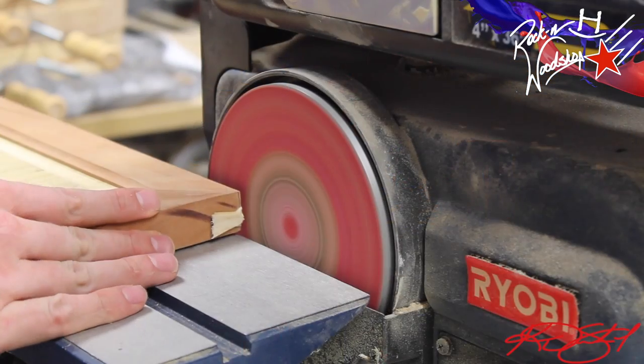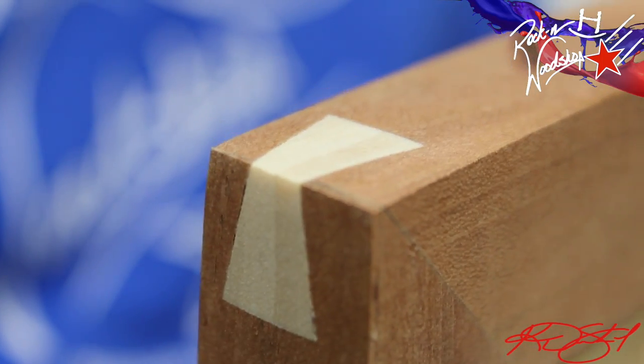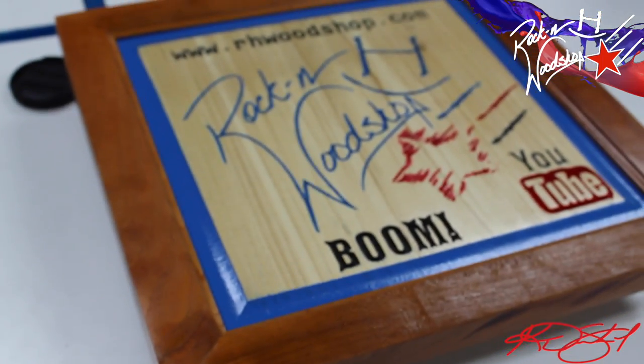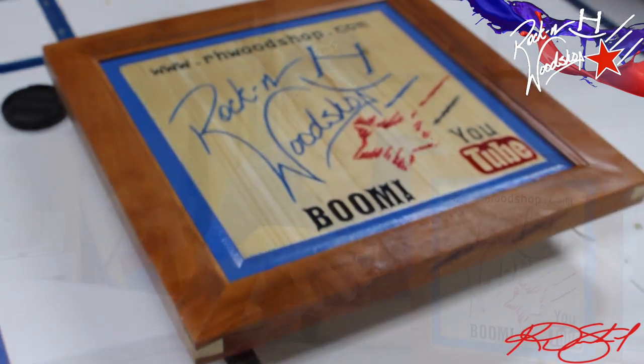This project was pretty fun. I enjoyed the CNC work because I've never had one before, never even attempted one before, and thanks to Next Wave Automation and Rockler for sending me the machine. For those wondering why I didn't run the plaque through the planer to take off the paint — since this was a very shallow carving, I didn't want to risk taking out some of that carving. Sanding was my only option, and I almost screwed it up around the star because that was really shallow. I had a really good time making this. The dovetail splines are going to keep this frame from coming apart even with all the humidity in this shop, so this sucker is going to last a long time. For information on the jigs and techniques used in this video, you can find those in the description or hunt through my archives.